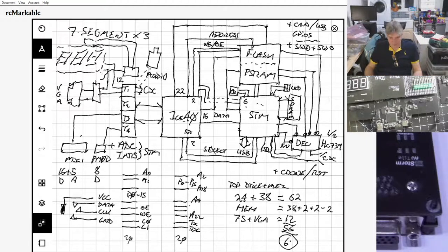So you may have multiple USBs, one of which could be a host, for example, if we wanted it to, for a USB keyboard adaption. You've also got the USB power delivery, which is why I'm talking about using both sides. I'd probably have power delivery on one side and all the other stuff on that side. I did toy with the idea of putting a USB A female host, but they're a bit bulky. And also the debug connector as well. Right angle debug connector. That's there.